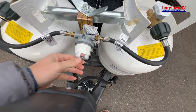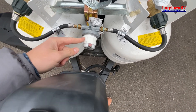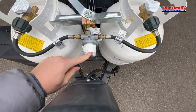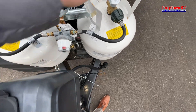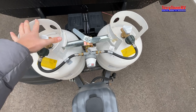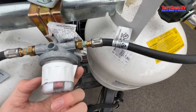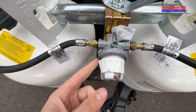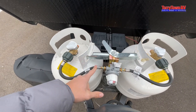Moving to your propane here — it's red because there's no flow through it. When you turn these on and they're filled up with propane, it will then turn green. You can also flip it to the other one; same situation — turn it on and it'll turn green. These aren't filled at the moment of this video, so that's why it's still red. This little pointer indicates which tank it's reading and drawing propane from — pointing left means it's reading and taking from this tank.